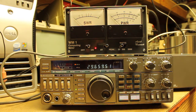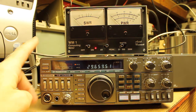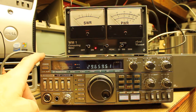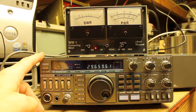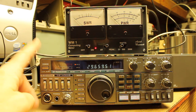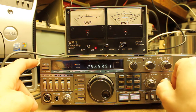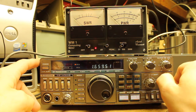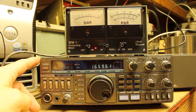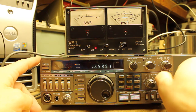I'd still like to have this TS-430S working as well. What I've already done is I've already pulled the RF and the IF unit out of this radio, checked for cold solder joints, found a couple of bad repairs for lifted traces that I went back through and repaired a different way, so that's a little bit more reliable. And that didn't fix the issue. There's one other issue I'm having with this radio, and that issue is that the audio output is very low — probably half, maybe a little bit less, of the audio output that I see on my other TS-430S.